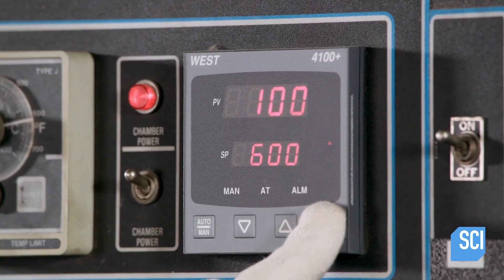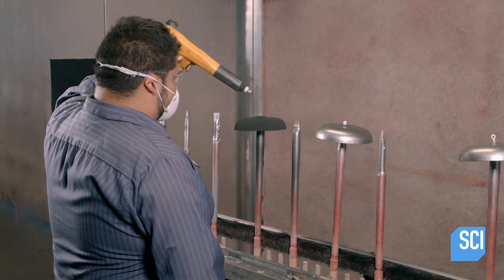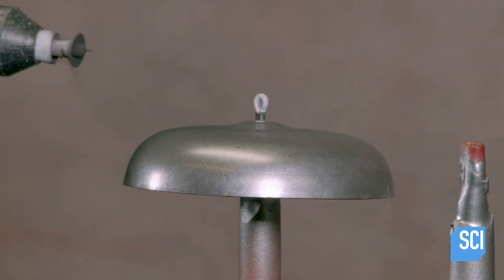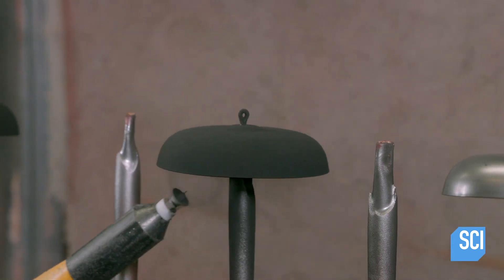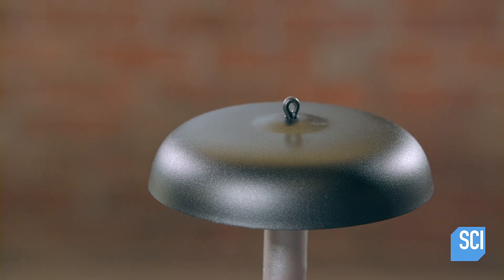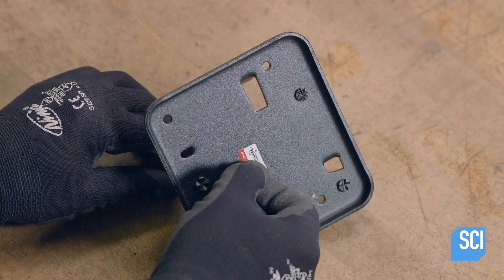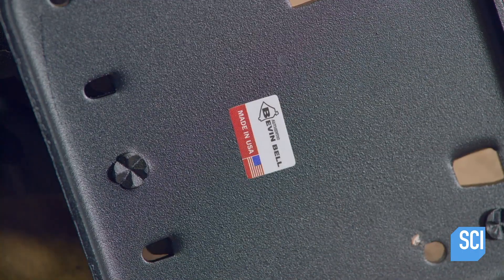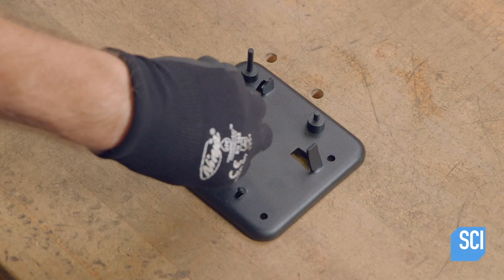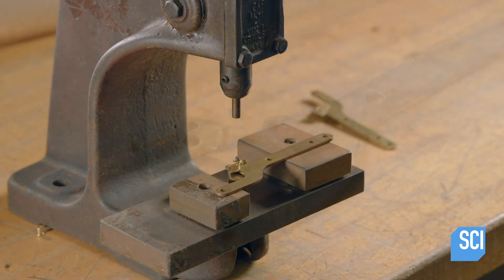The gongs are sprayed with a powder coating; when baked on, the powder particles form a protective skin on the metal and provide the gongs with a uniform finish. A powder coat is also sprayed on the bell's base plate, and an adhesive-backed company logo is applied to the back. Posts have been installed on the front for assembling the other parts — a brass lever for operating the bell hammer, and the mechanism that will swing it, called a dog.